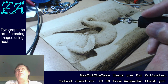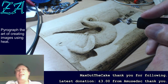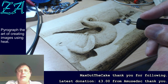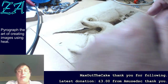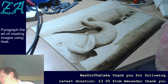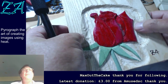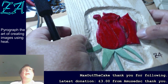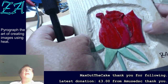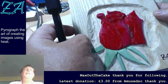Okay. Well, you've seen, Gray, how quick I am at carving. That dragon was, relatively speaking, for me at least, quite a complex piece to do, and it was really deep relief carving. If I was to do something fairly shallow, like the rose here, for example, I wouldn't do it on ash. If I was doing this on basswood, relatively shallow like this, I could probably do a rose in about 4 hours. As long as it's very shallow relief carving, it potentially becomes more commercial, and that isn't actually a bad image, relatively speaking, to do.